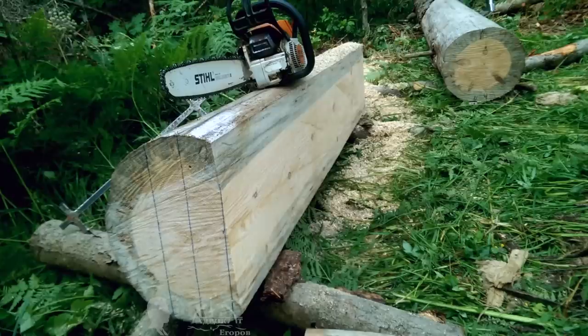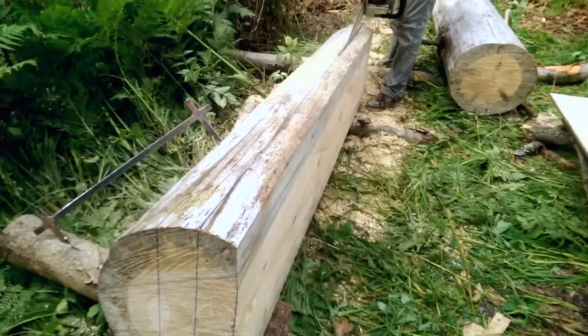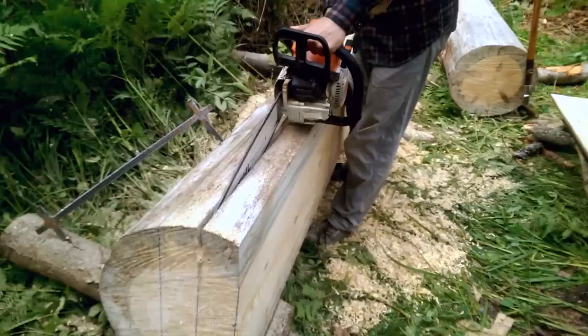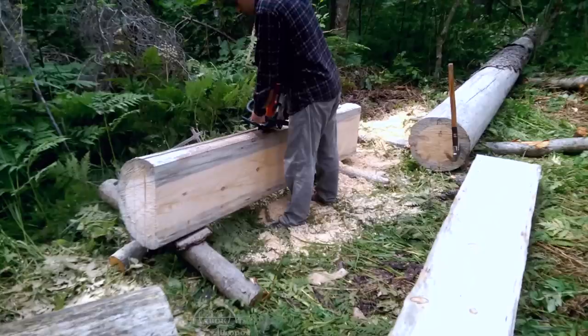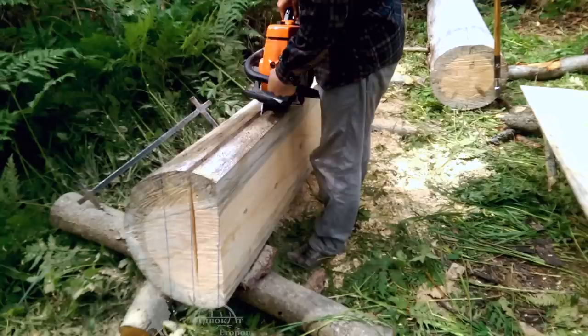The fungus has been dead in it for years, and you can safely use this slab for construction. I actually kind of like its golden grayish glow when you apply oil on it. You can tell that the kelo board is very old and has seen a lot during its lifespan. All of the kelo's sap has fully crystallized by now, making the wood extra dense, which means you have to resharpen your carpentry tools more frequently.